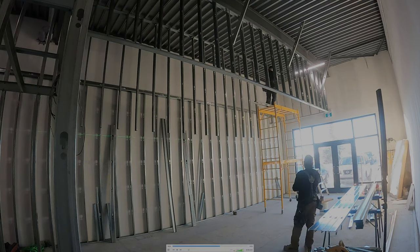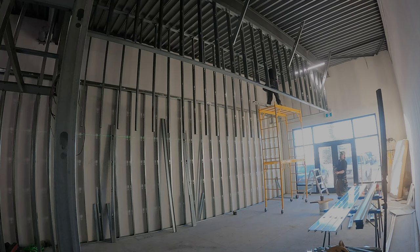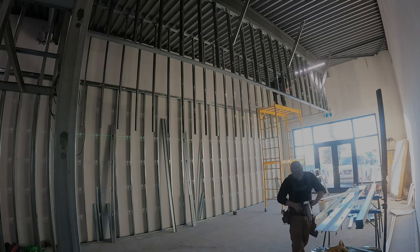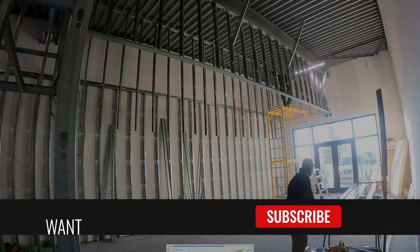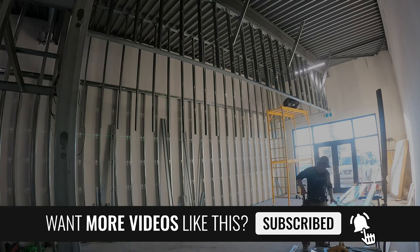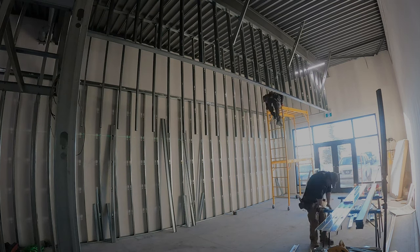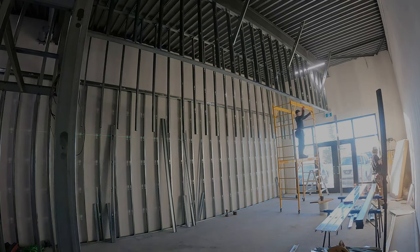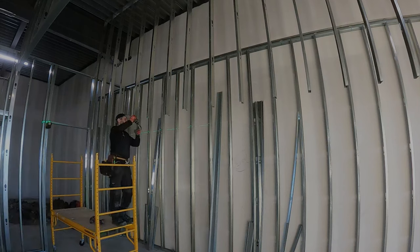We've checked the elevations on this one. He can't verify easily because of the baker. If you're on a lift, you can go up and down and verify. So when we tear down this baker, we're going to double check to make sure that we've got at least a quarter inch elevation — a quarter inch is actually the max — so there's a very slim margin of error there. A quarter inch is perfect above the elevation line. He's trimming some studs — that's the bummer of using a baker: you're having to trim your studs at the end.